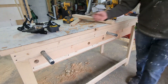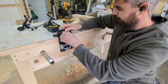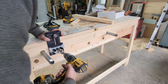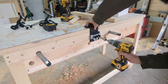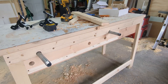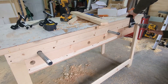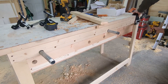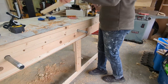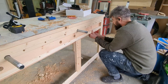There's one more thing I want to add to this bench. I've marked a line that is directly in line with the top of my pipes. I'm going to set my doweling jig so I can drill half inch holes that also line up with the same line. This honestly doesn't need to be perfect and you could just do this by eye. If you want to use commercially available hold fasts or bench dogs, drill 3 quarter inch holes here or whatever size is required for the product you want to use. I put a couple holes both in between the pipes as well as to the far right side of the pipes. With all that done, insert the sliding dead man into its slot, then install the second cleat to complete the slot and cap off the sliding rail.